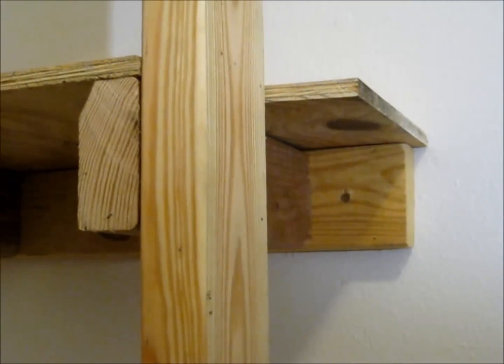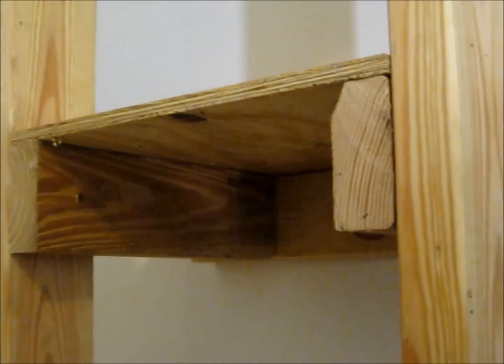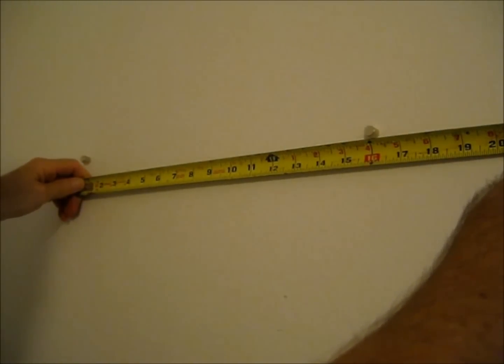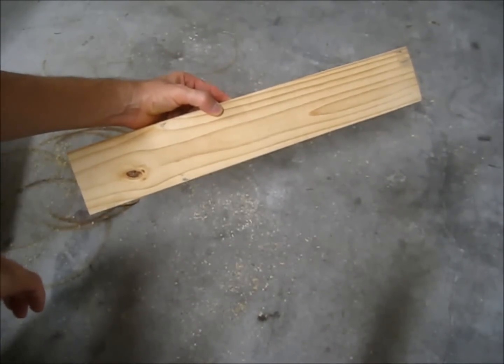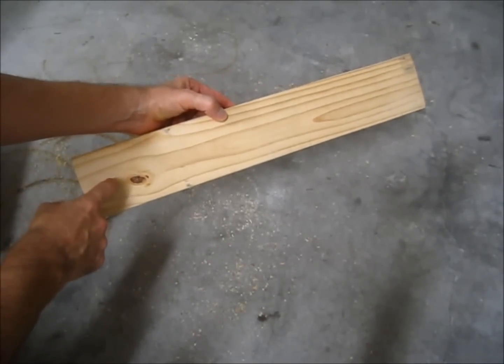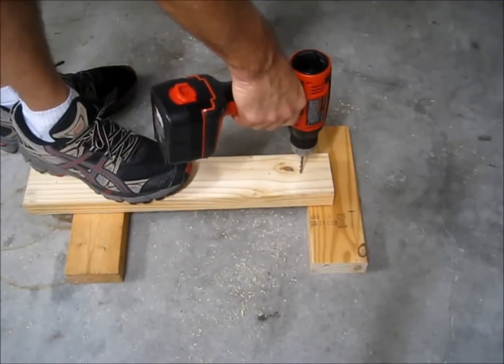The first and third shelves will be the shelves that attach the ladder to the wall. Since most houses, including mine, have studs 16 inches apart, I'm making my wall attachment boards 20 inches wide to allow a little extra to prevent splitting. Cut two 20-inch boards — these boards will have screws attaching them to the wall. Drill holes in both boards 2 inches from each end for the screws going into the wall studs.